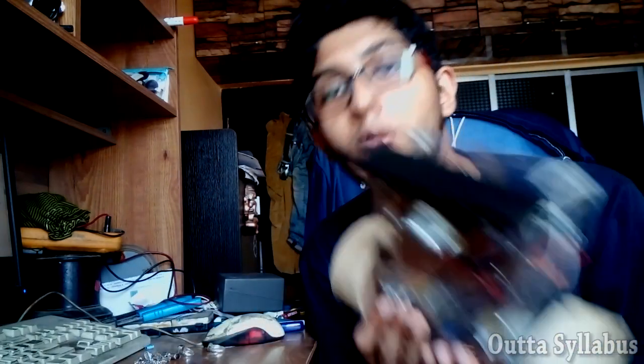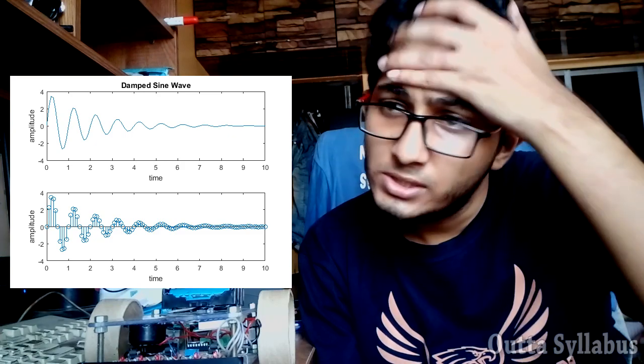You can try to fix the jitter using manual control algorithms, but that's very difficult and makes the code very long. That's why non-PID bots make these kinds of jitters — they always try to align to the line but never succeed because equal correction forces are applied on both sides. In a PID control algorithm, less and less adjustment is made until the robot settles, and the oscillation pattern resembles a damped sinusoid.